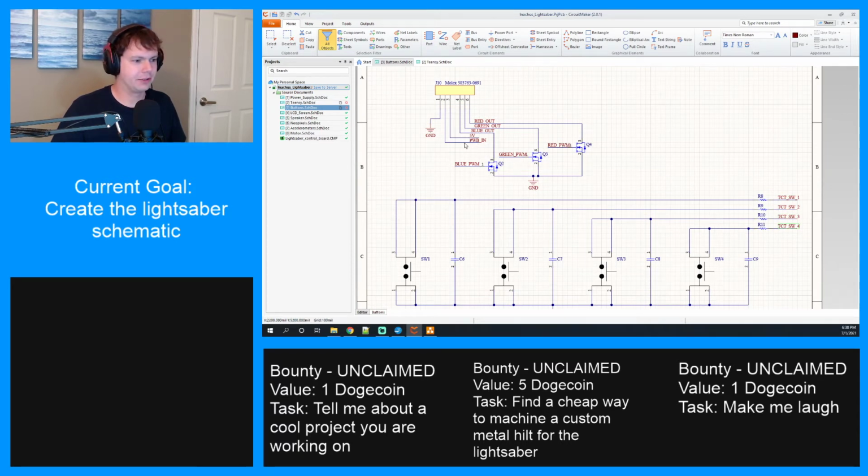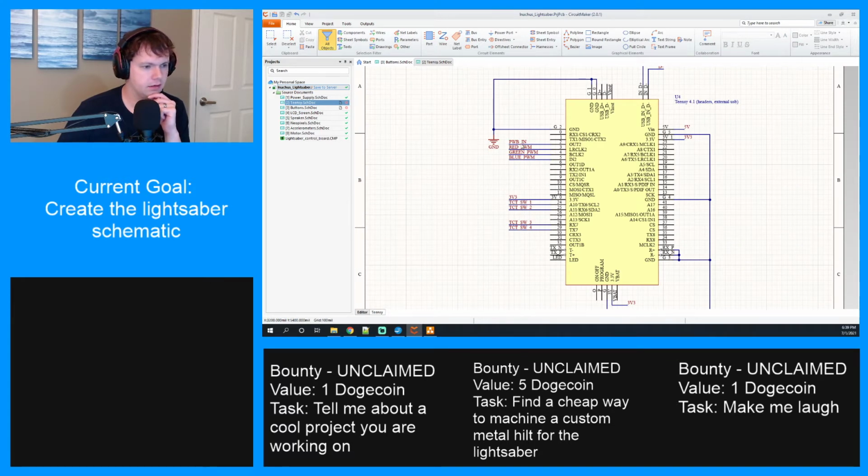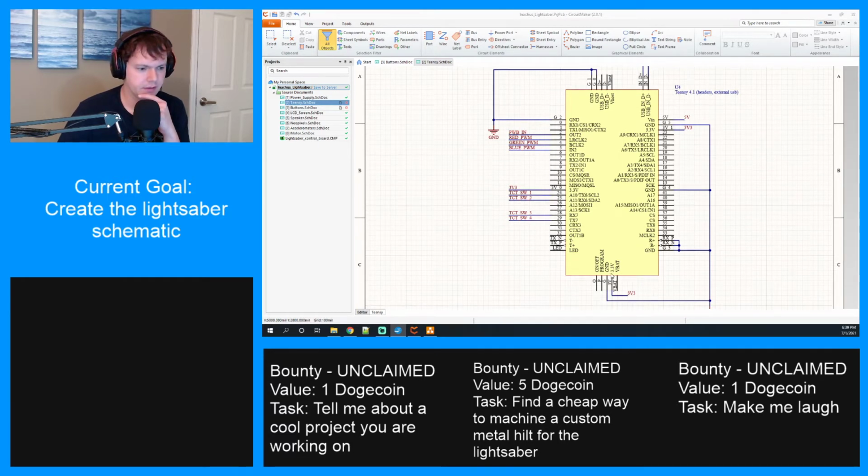I'm wondering now if our power button in shouldn't have had like, it'll be fine without any resistors or debounce, because that's going to the... Well, actually... Yeah, that's a great question, actually. Our power button in goes to pin 2. You know, we might have missed something here. I think this needs to go to multiple places. It needs to go to the on-off. Yeah, it needs to go down here, too.